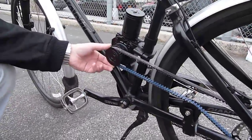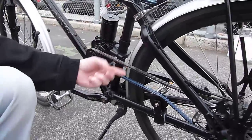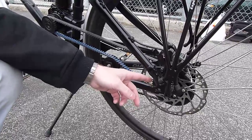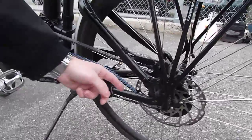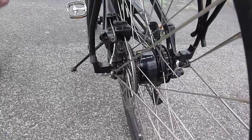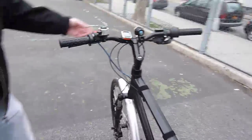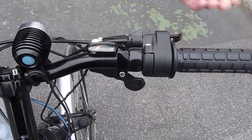So now let's take a look from this side. Instead of a grinder disc, there is a mounted pulley with a polychain belt. Here on the central lock, together with a disc brake, is mounted a big pulley — 50 teeth, made from aluminum 6061 T6 — and a tensioner at the front.